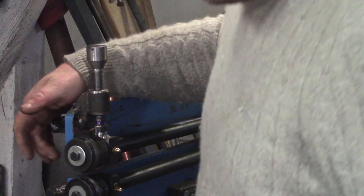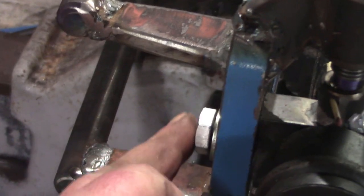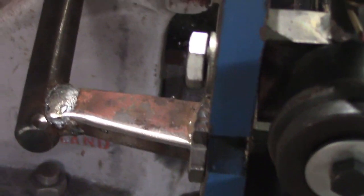The pressure bolt wants to have a bar and a winder on it. The only other bolt that gets frequently used is this bolt on the back here — you have to slacken that off to make your feed roll adjustment. I don't really slacken it off in practice, I just leave it a little bit loose all the time. But I'm going to want to alter the torque on that during operation, so what I'm going to do is have the bolt come out a little ways and then put a knob on the back of it. This one doesn't have to be super tight.